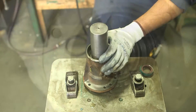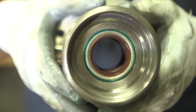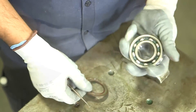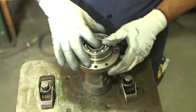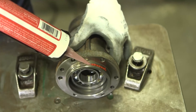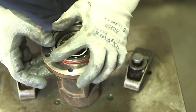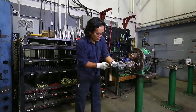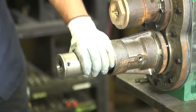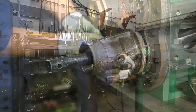There are five Viton lip seals on the inside of the large end cap. In order to avoid damage to the seals, they must be installed one at a time from the outside of the end cap using the main drive seal installer. Insert three of the Viton lip seals flush to the inner drive bearing step. Place the other two flush to the main drive bearing step. All seal lips must face the inside of the end cap. Remove both shields from the inner drive bearing and press it into the plate-facing side of the end cap until it rests against the bearing step. Apply high temperature liquid gasket to the O-ring groove on the face of the end cap and insert one O-ring into the groove. Push the end cap onto the gear shaft so it's resting against the end plate with dowel pin holes aligned. With a rubber mallet and bearing installer, tap the end cap tight. Install and tighten six socket head bolts to 27 to 30 foot-pounds of torque.